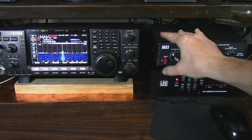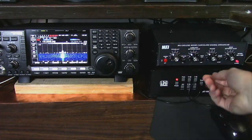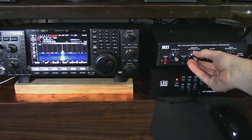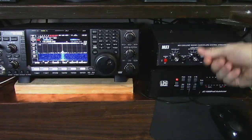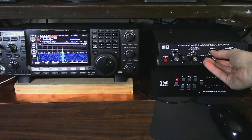So this is with it off — that's the strength we're looking at, S9+22 at 22 minutes coordinated universal time — and this is with WWV nulled. I've had good luck with local noise sources where the phase doesn't change; it's direct to both antennas at roughly the same intensity.